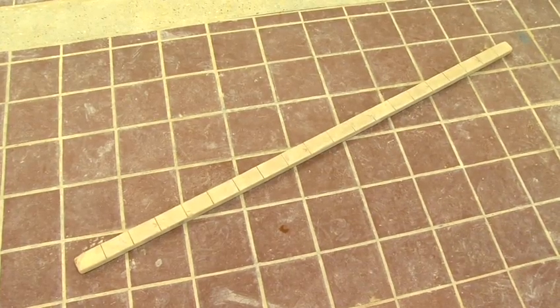And we would use a gauge rod, which is a piece of timber marked out with 75mm gaps. This is to gauge your brickwork, to regulate your bed joints, to make sure that your wall is going up at a nice rate and your bed joints are regulated.